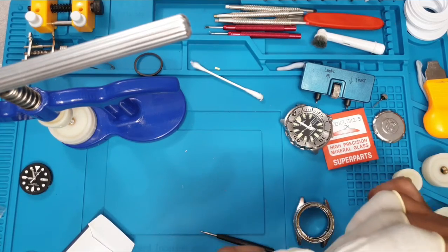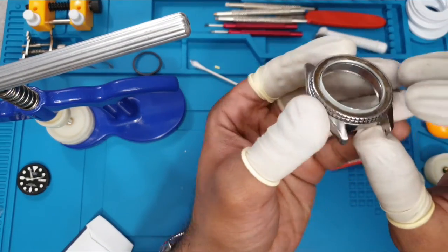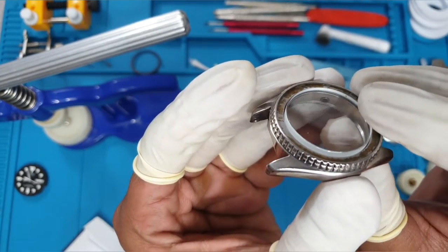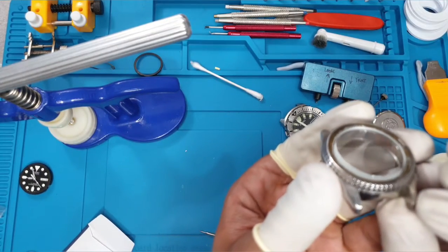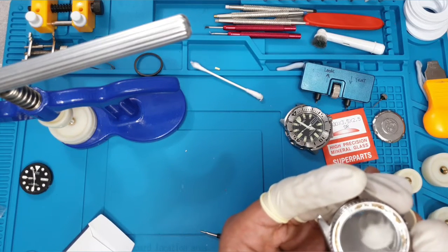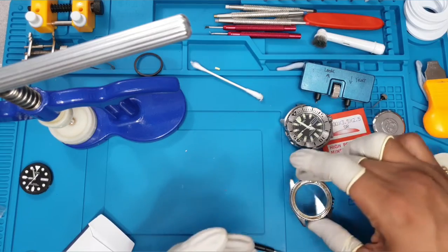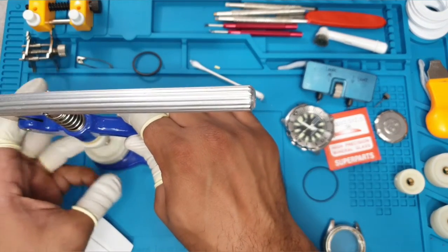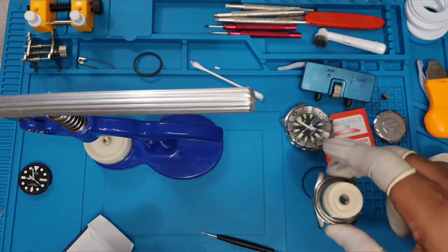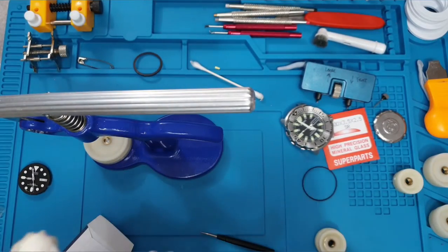To replace the crystal, you go obviously from the top down and just place it on top without pushing it too much. What you're trying to do at this point is make sure it is quite level — use your fingers to adjust it, make sure it's not up on one side more than the other, and just make sure it's as flat as possible. Attempt to place it just there before you put it on your press. Once you're happy with the alignment, take the die you used previously, turn it around, and use the side which covers the crystal closest to the edge as possible so you get to press it down equally on either side.